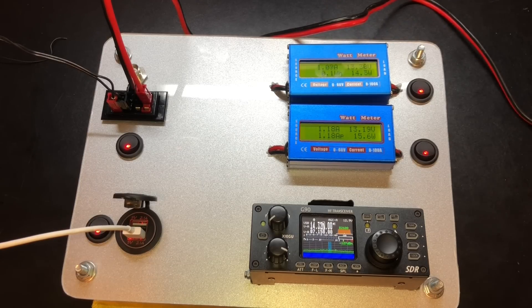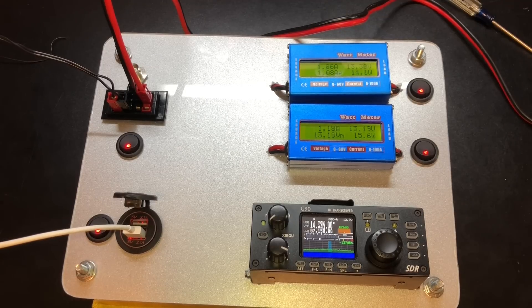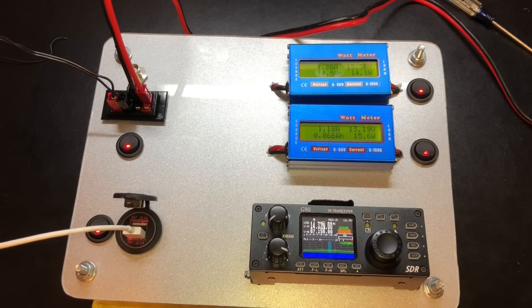I've hooked up my 100-watt panel and got 5 amps out of that. It charges the battery right up to about 14.4 volts, which is a little low for full saturation for this chemistry — they usually charge to about 14.6 to 14.65 volts — so it's not reaching full saturation, but it works.